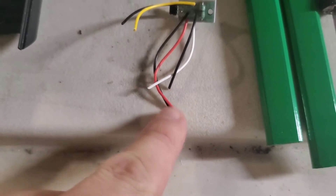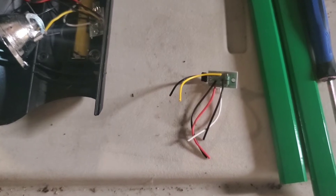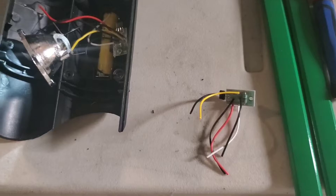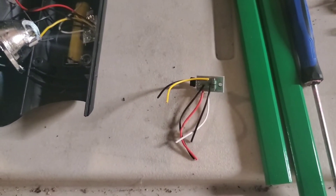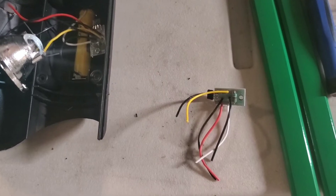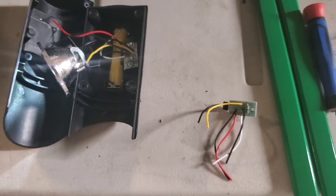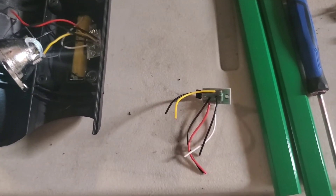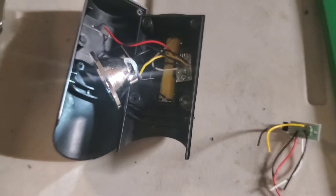You're going to want to strip the end off of all of the wires. On the lamp, this board performs the function that when the solar panel is receiving power, it turns off the light so that the battery can charge. And when the solar panel stops receiving power, it turns the light on. We're going to be reusing this so that when the solar panel is charging, it charges all of the batteries in this system. And when the light kicks on from the solar panel not having light, it will cut the batteries we're going to be charging out of the system so that the light only runs off of the battery we have left in the lamp.